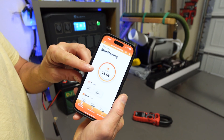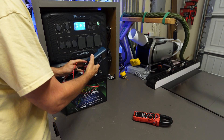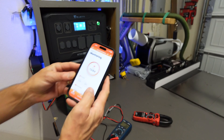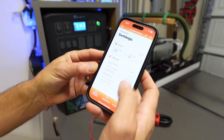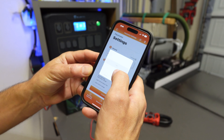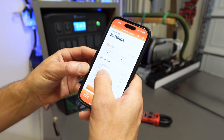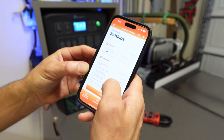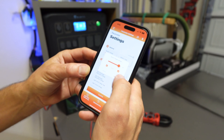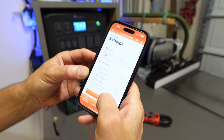Now the app is showing my battery at 13.6 volts — my multimeter reads 13.55, so fairly close. Going into parameter settings, you can set the battery type: flooded, sealed, user, lithium, or gel. I selected lithium. The boost charge voltage defaulted to 14.4 volts. I changed mine to 14.6 volts and confirmed, leaving everything else — over discharge reconnect at 12.4 volts and over discharge disconnect at 10.8 volts — the same.